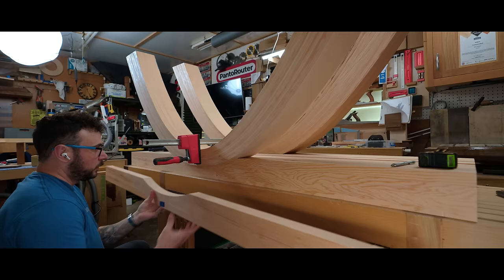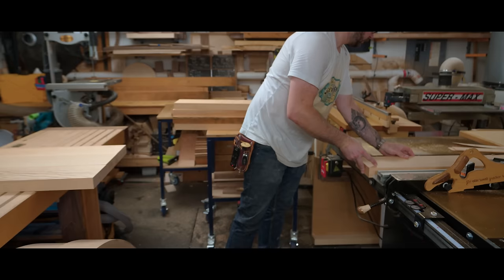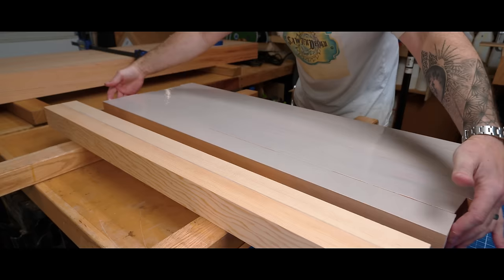And now you can see why I left those front boards off the slab in the top. The nesting of the curves of the slab is a bit of an illusion. Before we can get the arches glued to the top, a few things have to happen. The shelf needs to be assembled and ready to glue up at the same time, as well as the back side of the main vise called the leg vise. The front side of that vise is called the chop, and that's what I'm gluing up here.